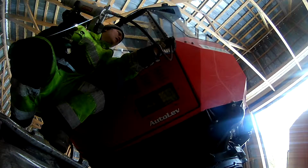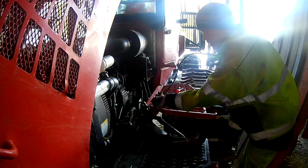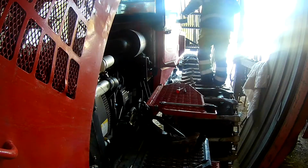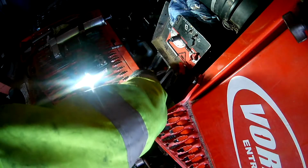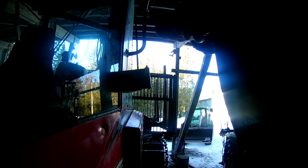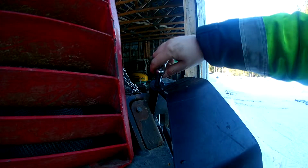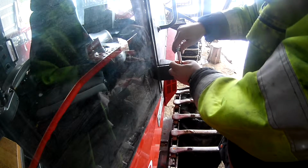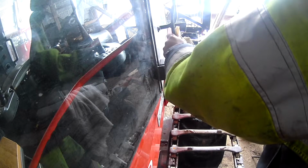Tried adding a little bit of grease to the joints, the hinges on the door. Also on the ladder on the forwarder, one grease fitting here needed replacement. The door also had a bad grease fitting, so they were unbolted and replaced. The one on the door hinge had kind of a wide flange on it, and we didn't have any of those, so we just added a washer on it also to help cover the hinge itself, maybe reduce the amount of water that gets in there.